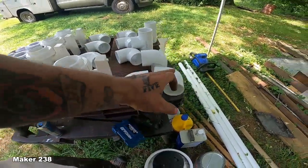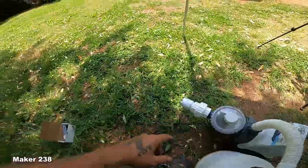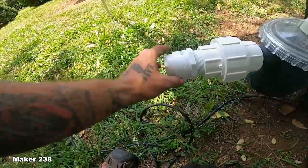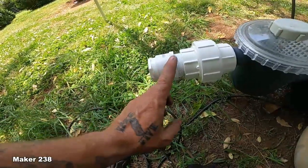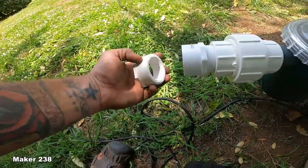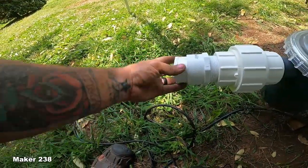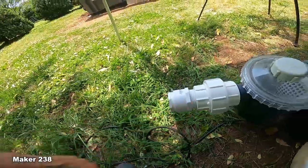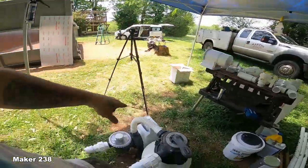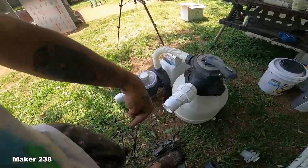That's gonna come down to a 45 and then another 45, and then go directly into the inlet of the pump, which I've got a 2-inch coupler, screw coupler here. Then I've got a 2-inch screw to 1/2-inch slip. No, 2-inch screw to 2-inch slip, and then a 2-inch slip to a 1.5-inch slip coupler or adapter there. So that's going to be the intake. That's coming from the skimmer, sucking into there, and then that's going to go through the pump, go through the sand filter, and then back out